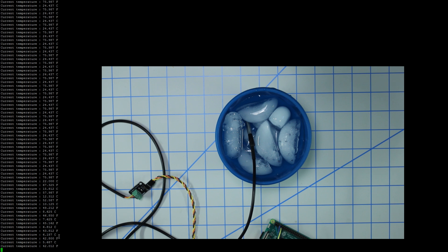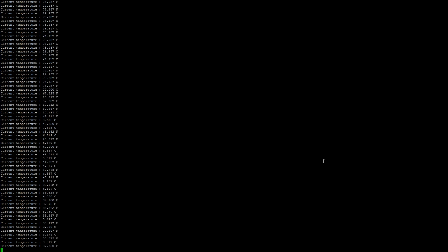You can see the temperature dropping quite rapidly — from around 10 degrees Celsius and falling. So we know it's working. It's pretty straightforward to get the DS18B20 sensor up and running with the Pi. It's useful because it's waterproof and handles a decent range of temperatures. For accuracy, I think it performs a bit better than the DHT11 — I have a tutorial on that in a previous video. I hope you enjoyed this tutorial; leave a like or comment, subscribe, and stay tuned for more content. Thanks guys!